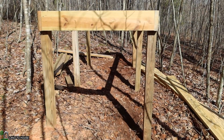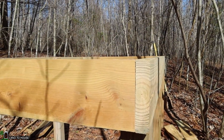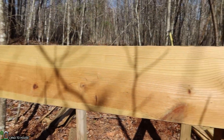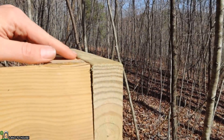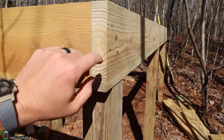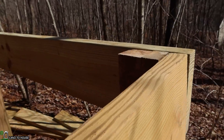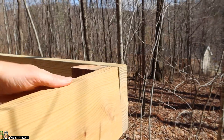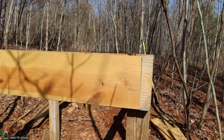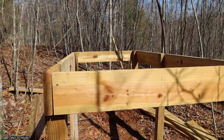This took a lot more fiddling than I was anticipating, but I've managed to get the base frame done. If you were to step right here on the edge, you can see just how level this is — that's really good. I went ahead and got the sideboards on, and this right here looks just like the other side. I've notched out all three of the supports before putting this on. I need to go back and put a bunch of nails on all these sides. I've also got some corner plates for extra support, because this is going to have about 600 gallons of water, which is several thousand pounds. I want to make sure it's nice and strong. I'm going to go take a break for a while.